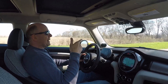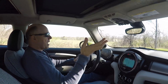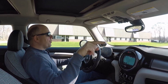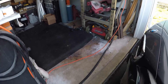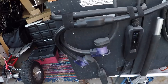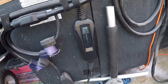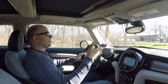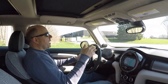Initially we bought the Model 3 and that was my one car to charge. I have a NEMA 14-50 240-volt outlet in my workshop. I bought an 8-gauge, high-current, 50-amp NEMA 14-50 extension cord to move the power from the outlet to the front of my garage, because I don't park in my garage — it's a workshop. Then we got the Smart and I got a J1772 charger for that, and now we have the Mini Cooper. The problem is that the way my garage is laid out, access to the fuse panel is nearly impossible — it would require heroic measures to run a second 240 circuit. So that leaves me with one charge circuit.